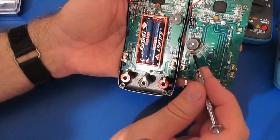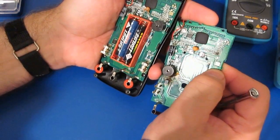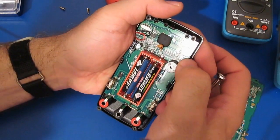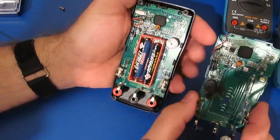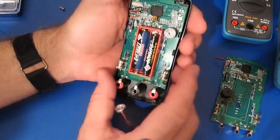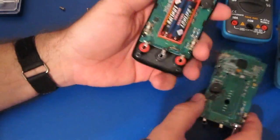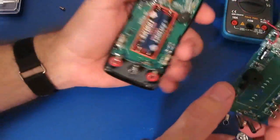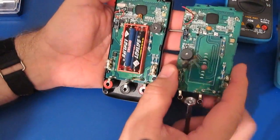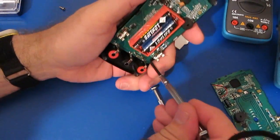Looks like the diode here is in the same location. You can see what was marked as the range switch, and this is SW3. SW3 is marked up here now, so they've moved the location of that. But yeah, they're similar, but quite a bit different, really. As far as hitting this with an ESD pulse, I couldn't say that this meter would actually survive like this one without actually running it. The circuit boards are different enough that I would be just guessing. That's why we run the test.